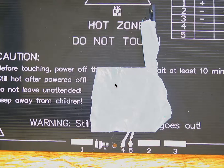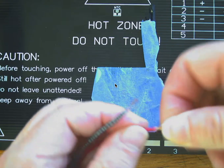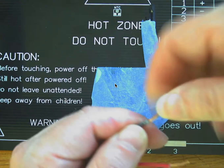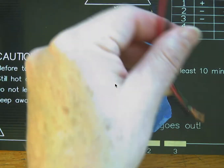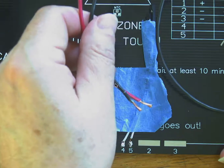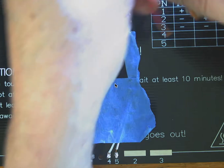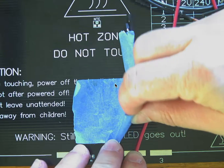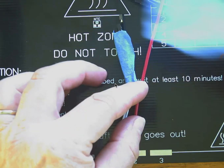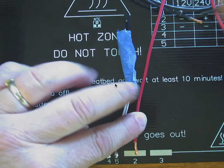The right hole, right wire size. It makes things easier. All right, so we got our wire stripped, and again, I would kind of string the strands together and get them situated here. So remember, the 2 says plus, and so the red is the plus, black is minus, is ground most of the time. So we're gonna again run these back in towards the board, and maybe bend them a little bit down so they kind of have a little bit of pressure when you put them down.